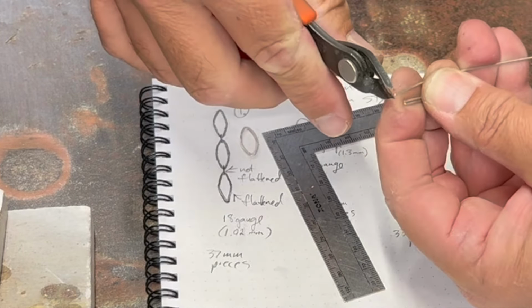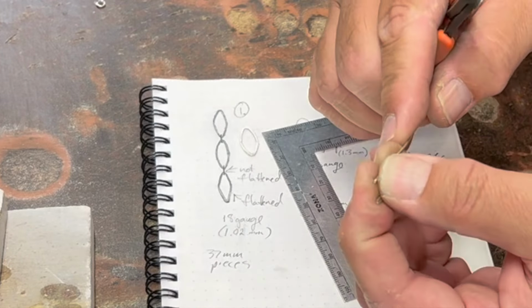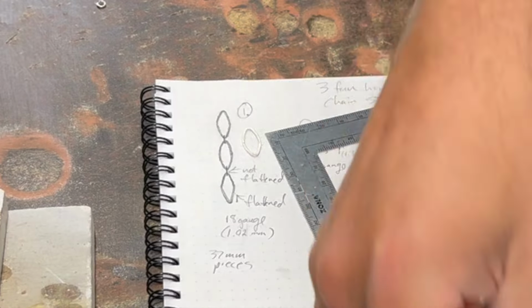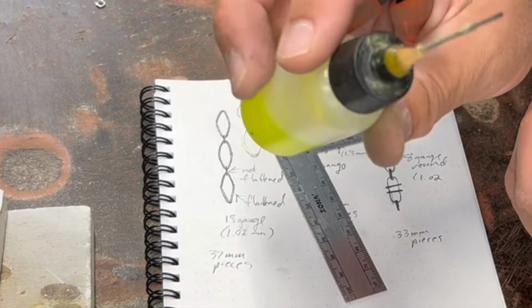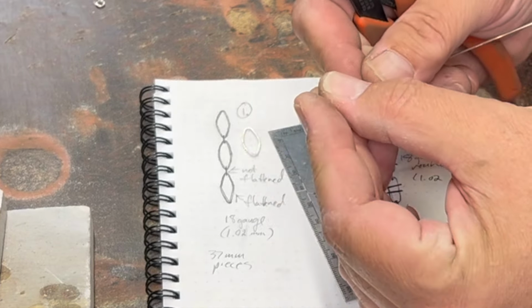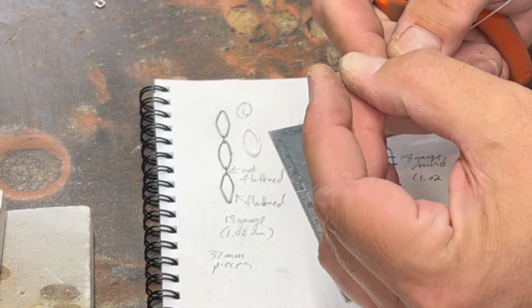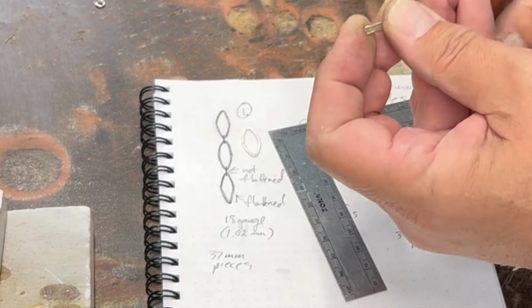If you haven't been to my channel before, I use hard silver sheet solder, which looks like this primarily, and I use a liquid flux. This is My-T-Flux, and I dribble it on generally, although I do have a spray bottle that I use sometimes. I used to spray all the time, but then one of my YouTube subscribers sent me a little dribble bottle like that. I really like it.